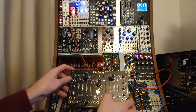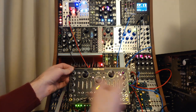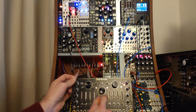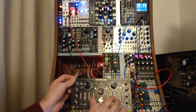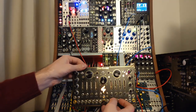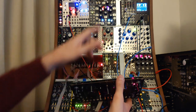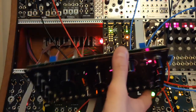The next thing to calibrate is the balance between both oscillators. When this knob is in the center, the main output should give you a balanced ratio of the left and right oscillators. There are two things to calibrate: first, the gain of the left and right oscillator — on this build the trim pots are a little difficult to reach, but the output of both oscillators is about equally loud. Second, calibrate the two trim pots on the top: turn the blend knob to the middle, turn one oscillator up on the left side, adjust the trim pot to a certain volume, check it on the oscilloscope, then listen to the same oscillator on the other side and adjust its trim pot until the volume is about equal.